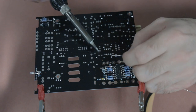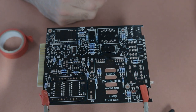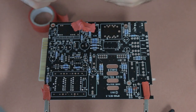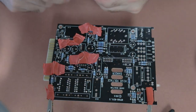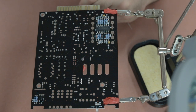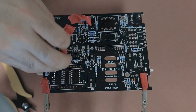Next up are a bunch of test pins. You can see me pushing them in with a bit of electrical tape on my thumb because they can be quite hard to insert and were actually breaking the skin on my fingers, so the tape helps push them in. Some will go in nice and flush, but some tend to fall out as you turn the board over to solder. I taped them all down in place to make sure they didn't fall out before soldering, then flipped the board and soldered them all. After that, there's a raised spike to snip so the pins are flush on the back side and won't short any circuits.